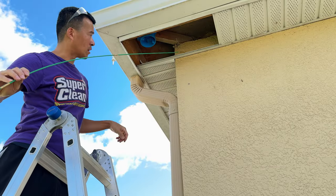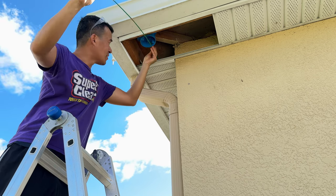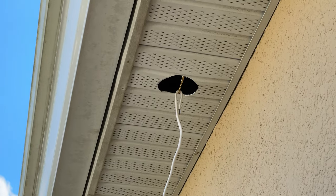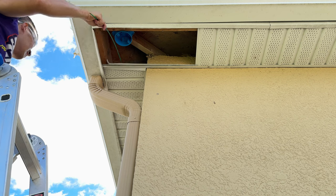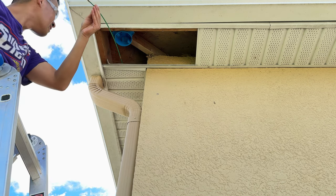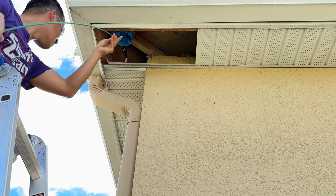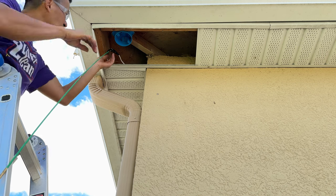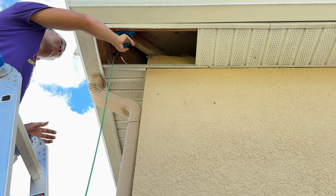To make our wire pull easy I'm going to use this little rod right here just to push it over so we can see it and then pull the wire through. If you guys need the same tool check out the link in the description on Amazon. As you can see we got the other side of the rod right there - I just looped the wire through it and on this side we just go ahead and pull it through. Once we've got it, we'll leave it here and use tape to kind of hold it in place so I can get it into position to make the connection later.